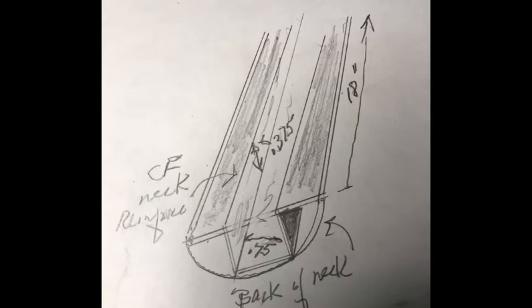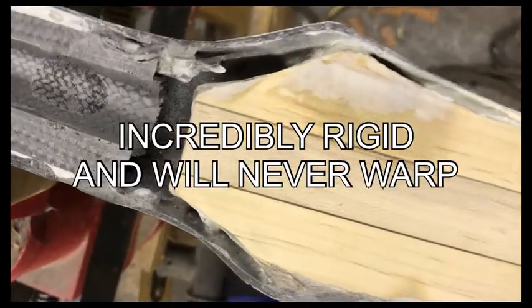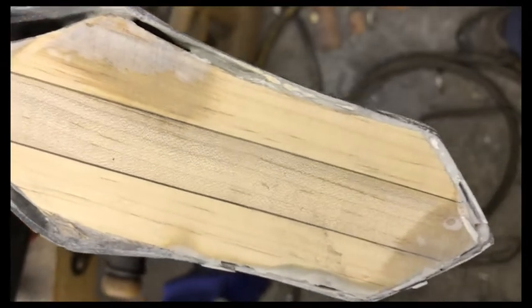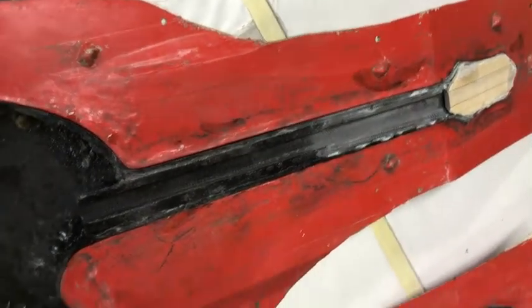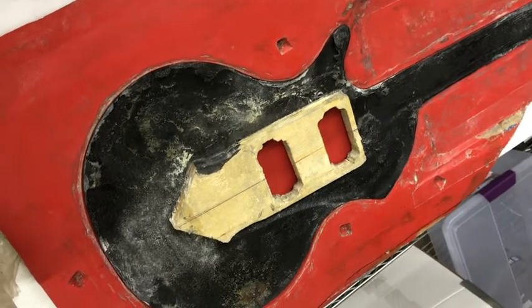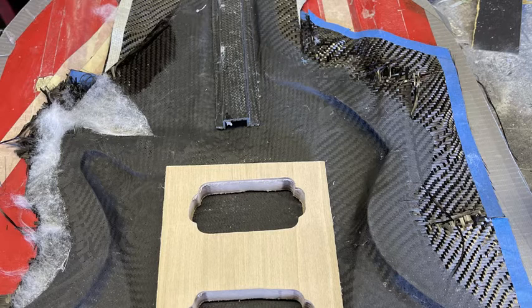This is just a drawing showing you how it fits in place. Put a lot of thickened epoxy in there so that there's good squeeze-out all around — you can wipe that off or make sure all the areas are coated. For the top part, I use a wood block that fits in. The wood block just provides a good anchor point for the tuners and the screws. Here I've got the part clamped in a vise trying to move it — it's just not going anywhere. When you're putting all this together, you put your two halves into place after these parts are glued together, your wood pieces are epoxied in. Wax your molds — I can't stress that enough, otherwise they're never going to come apart. Trim them to the point where they're flush with the mold ends, and if you're going to have any overlap at the ends, make sure you sand it as thin as possible, then just glue them together.